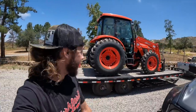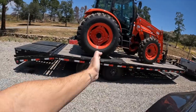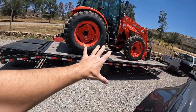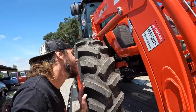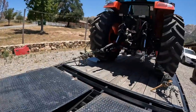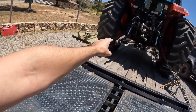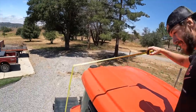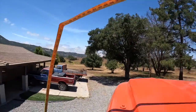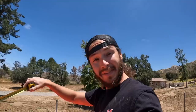I think we just give this a try. Right where the axles are there's a decent amount of weight — the loader is the heaviest part. We could scoot it back a little bit, but I'd rather have more tongue weight than less. Definitely don't want no tongue weight and have the truck and trailer get wild down the road. We got to chain this thing down and unlike skid steers there aren't a lot of great chain-down points. I just looped around the axles — the most solid point I could find. The only thing I don't like is it kind of rubs the tire. We're sitting at just about 11 foot 3 or 11 foot 4 — definitely not as tall as I thought.